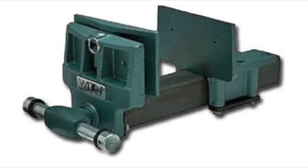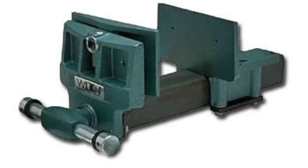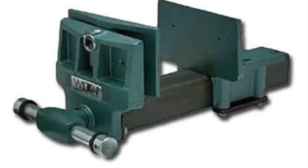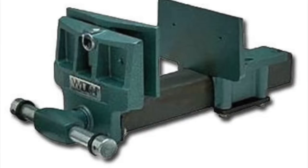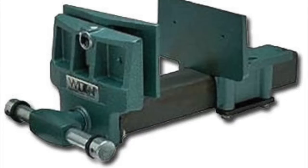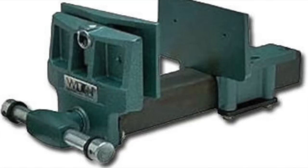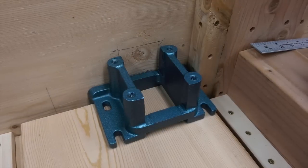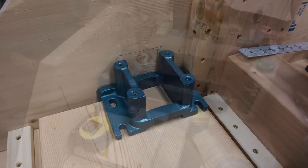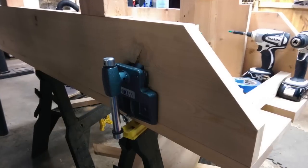For the face vise I went with a Wilton seven inch metal draw vise. The installation was pretty easy. It has a removable pivotable jaw which I removed, as I was planning on doing my own chop for the vise. I can always put the pivoting jaw back on if I ever need it. One thing I liked about this vise was that it had a single screw going through the middle, covered to keep sawdust out, with no extra guide bars - a nice feature to clamp pieces vertically without guide bars getting in your way. I inserted it into the underneath side of the bench, marked where I needed to cut the hole for the screw, did that, and then reattached the plate that secures the screw to the back end of the vise.